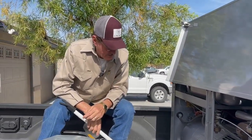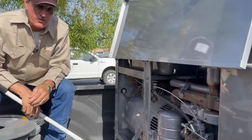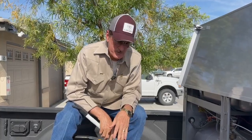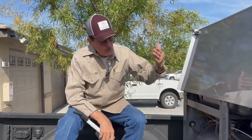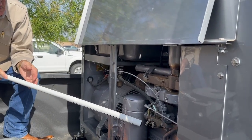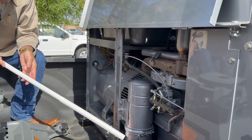There's a problem in these 200s. Here's your gas valve from your fuel tank. The old manual says to turn them off every night — the right way is to turn the valve off and let the machine run out of fuel while you're rolling up. Most people never did that, and it's even harder inside a truck like this because you have to pull the cover up. What will happen is some debris and trash will get in the carburetor — there's a little needle valve in there. You'll have fuel leaking on the ground through the overflow, or it will leak inside the air breather and go down into the oil.